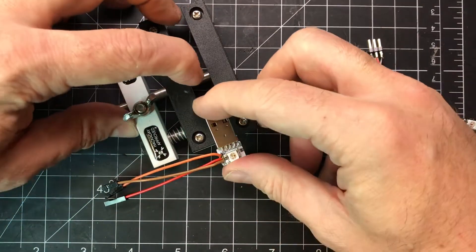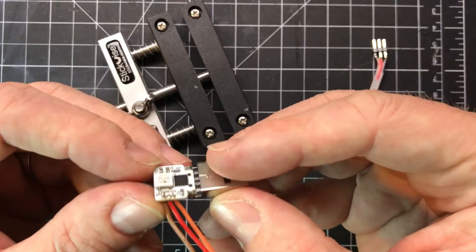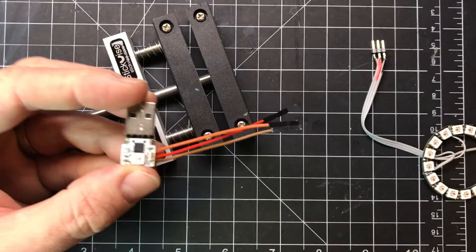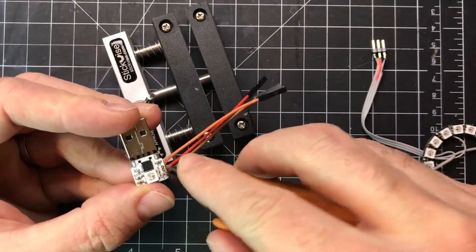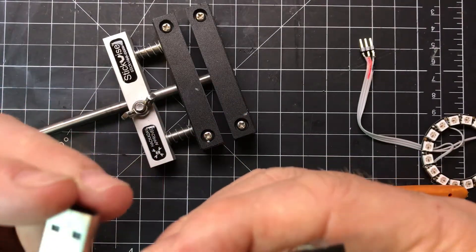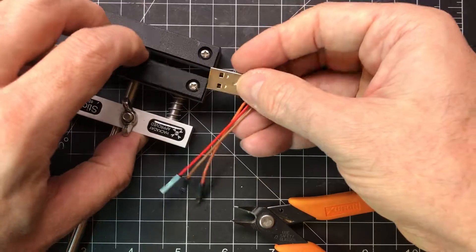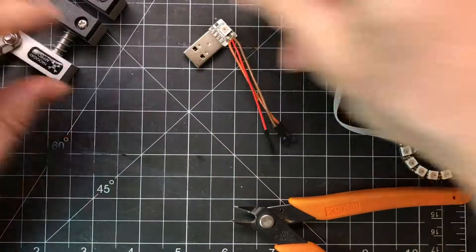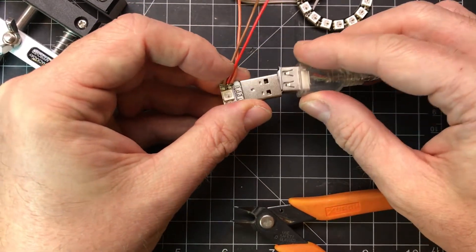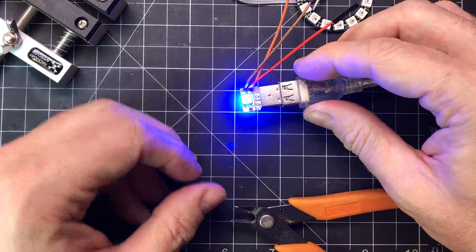Unfortunately that means the wire is going to be sticking up pretty high on the other side, so you just have to trim those down. Just a visual inspection here to make sure my solder joints aren't too bad — so let's trim those down. I don't think I see any shorts, so let's plug it into a protected supply first before we plug it into a computer, and see if it does its little built-in light pattern. And it does, which means we don't have any shorts.